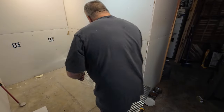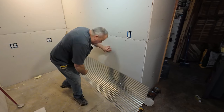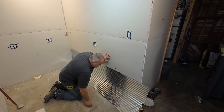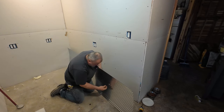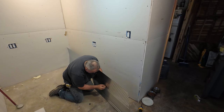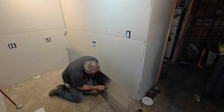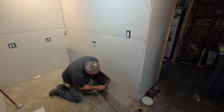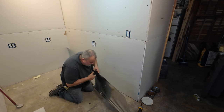All right, I got my holes drilled. I've got these 1 inch or 1/2 inch rubber grommets because you don't want the wire hitting this metal. So I'm gonna attempt, I don't have my reading glasses. But it's all right, you ain't reading. You're pushing. So hopefully I can fight these in there so that that wire doesn't get cut. It's easier said than done, but they're going. But the problem is it's not real smooth. Try to put it in from this side.